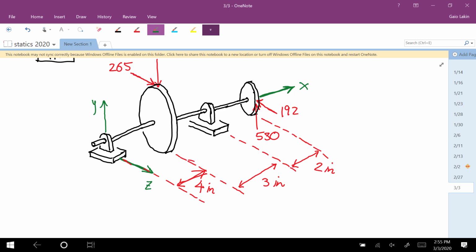So what we're going to isolate is the rod and the gears. And we have those two pin joints acting on it, the loads from these 2 pin joints. And pin joints are the complicated ones in 3D. So remember, they can apply couples, but they don't always. And so anytime you see a pin joint, you have to ask yourself, am I applying those couples or not in this case? In this case, it's 2 pin joints working together with the same axis.